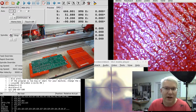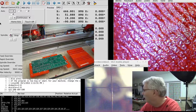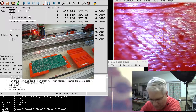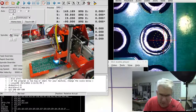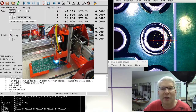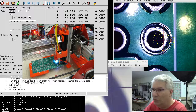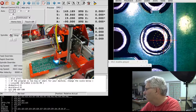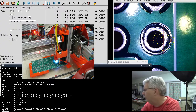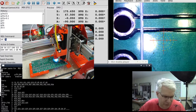That got all straightened out and I'm actually getting really good results now. We'll do a mock run — you can't really see it well on this camera, but you can kind of look at the speed. You can see the Z axis moving up and down, moving over the pins. We're going to pretend like we're placing the 220-ohm resistors down here. What it's doing now is moving over to the location of all the pads for those resistors. The relay connected to the second parallel port on my PC runs over to the solder paste dispenser — a timed relay connected up to an air compressor.